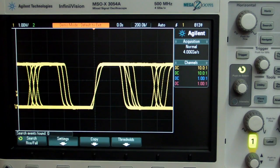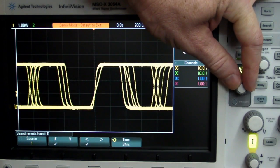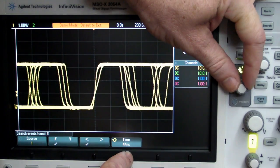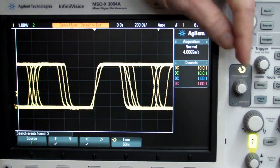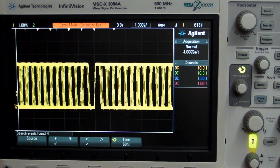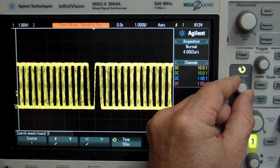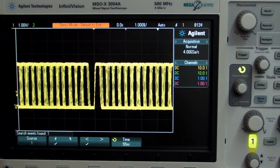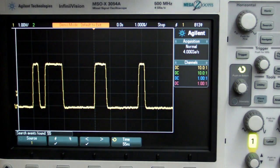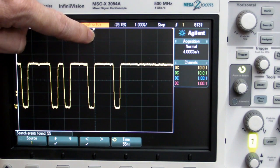But if we go into settings and then we adjust the time here, if we increase that, it's 30 nano. If we keep going up, we'll find, bingo, we've suddenly got violations, and you can see where it's actually violating that time there. Bingo, it just comes and goes. You can set those thresholds and it will pick it up. It's fantastic. And of course you can stop and capture that, and you can actually scroll through and it'll go through the event search like that.